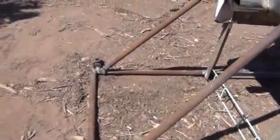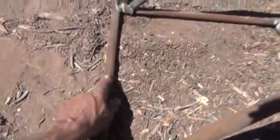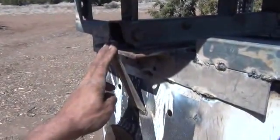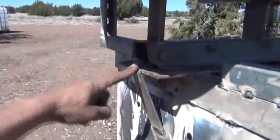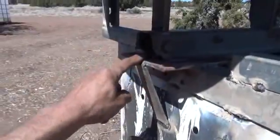I'm actually going to still install one more bar here. That bar is going to run from the center of this rear bar up to right here, acting as a secondary brace. When the barrel comes out and pivots off of that on the weight, it flexes this point downwards. By adding another brace running all the way down, we'll be able to strengthen that pretty well.